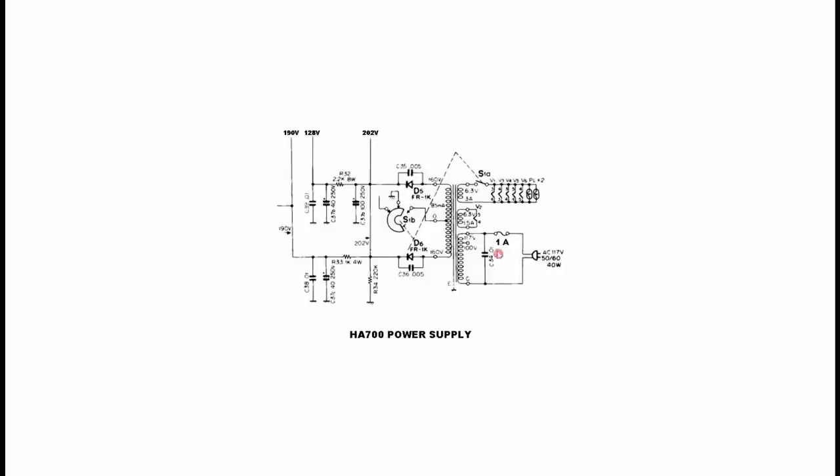It looks like the line voltage is attached directly to the transformer. Where's the on-off switch? This is a very clever system that keeps power on the local oscillator mixer tube all the time — so as long as it's plugged into the wall, the receiver, even when it is off, will keep that tube lit up. For high voltage, it takes care of that with the on-off mode switch S1B — when you're off, it disconnects the center tap of the transformer so we do not get high voltage out. However, be very careful: do not oversize this fuse, or you will have something happen like happened to this receiver, which has a fat 5-amp fuse. It should be a 3/4-amp or perhaps a 1-amp fast-blow fuse.